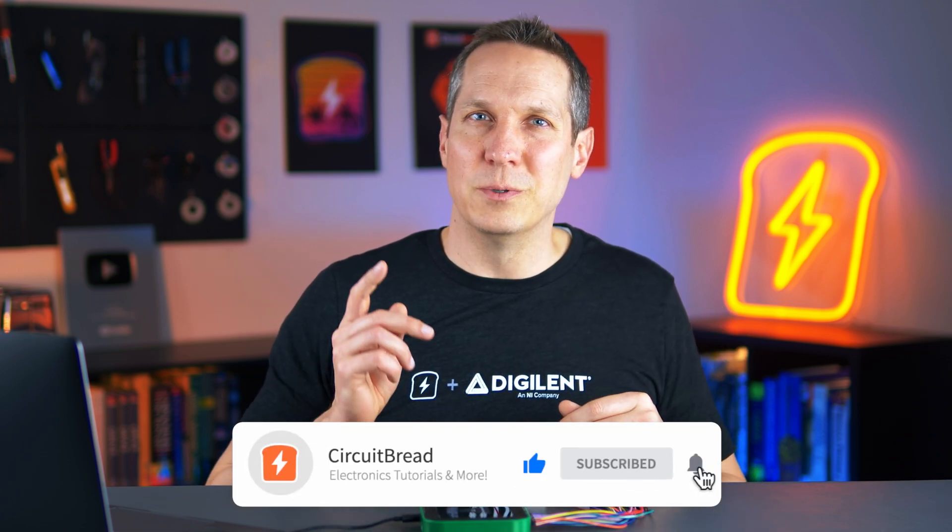If you set this up properly with the right tools, this is actually an excellent way to find out very precisely what a resistor is. My current setup is not so great, but properly set up this concept applies very well. This is also really good if you have something like a strain gauge — where bending it changes resistance — it's fantastic in this setup with an op-amp so you're not putting load on it, converting the high output impedance to a low output impedance, amplifying if necessary, and feeding that to the ADC on a microcontroller. That's a real application for this exact circuit. We want to thank Digilent again for their help and support. If you found this helpful, give us a like, subscribe, and we'll catch you in the next one.